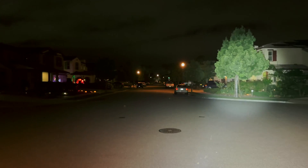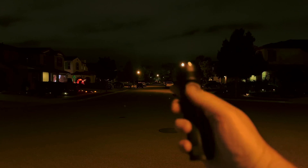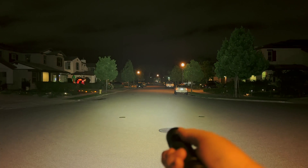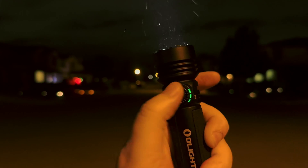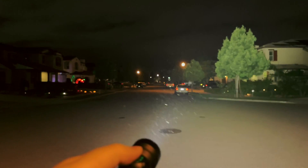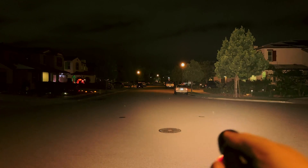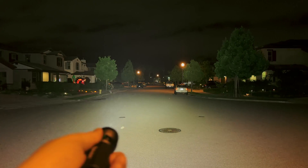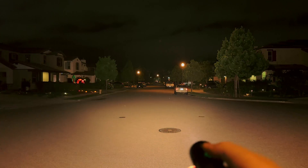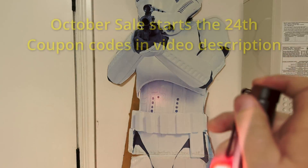Warrior 3S with stock SFT-70 on turbo — this one obviously destroys all of them. Here is the Seeker 4 Pro with neutral white Osrams — what a great light. This is another light where I'm not sure it's a great idea to swap it. It's still hitting turbo even at less than full charge. Now the Seeker 4 Pro on the right has the Nichia 519A mix — the 2700/4500 tint mix versus the Osram P9s at 5000K on the left. The Osrams are clearly brighter; you've got high CRI on the right and more lumens on the left.